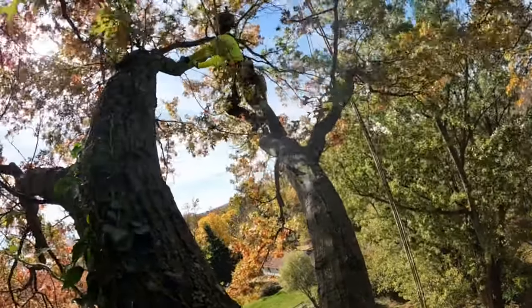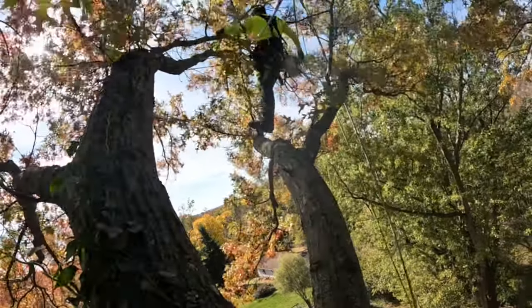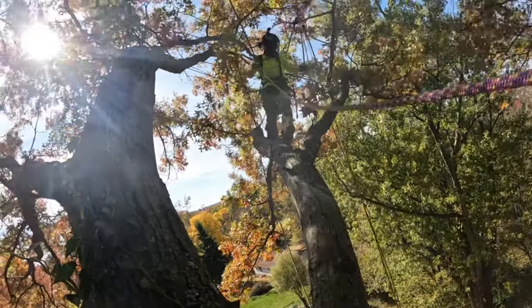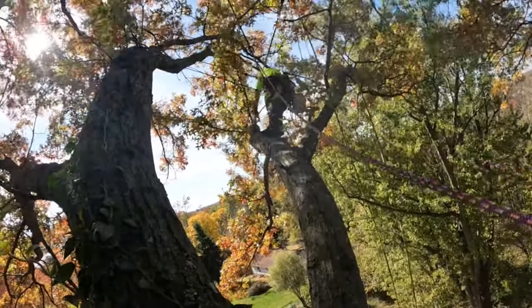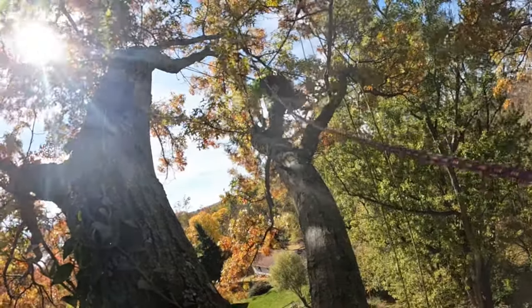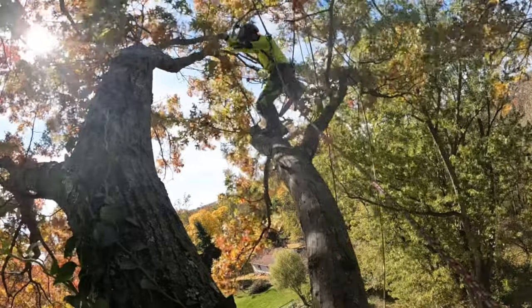I'm going out to set the first pick. I'm using crane slings to try to balance the horizontal limbs as much as I can. We didn't put a whole lot of time into balancing — we just wanted to try to minimize some of the dynamic forces that the system saw.